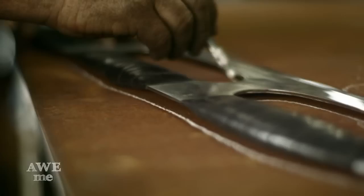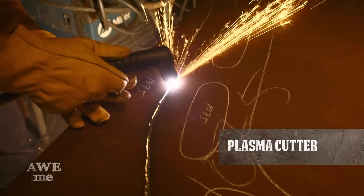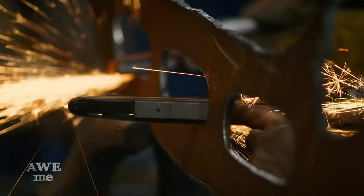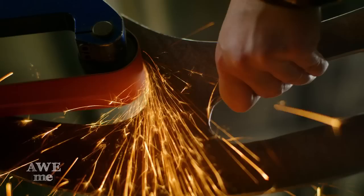I did a quick trace of the Chinese knockoff directly onto the piece of 1075 steel, and plasma cut that out by hand. After I cut out the interior handholds on the batleth, I had the guys take the pneumatic belt sander and sand off the imperfections, since the plasma cutter doesn't leave a perfectly smooth cut on the handholds. Then I took it to the belt grinder with the 36-grit belt and ground down the profile, using a small-wheel belt grinder to get into the inside cuts for the outer curved blades.